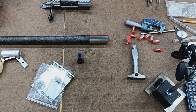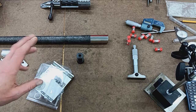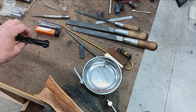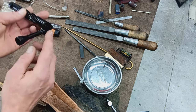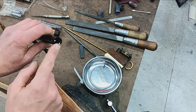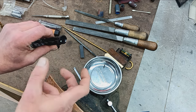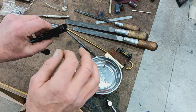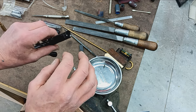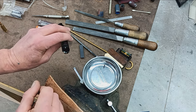We'll go over to the vise and take some measurements and record that data, get all our dimensions established for the barrel. Another thing to do before really anything else is preparing the bolt — we removed the firing pin assembly; we're also going to remove that spring-loaded ejector, which will interfere when we're headspacing. You don't want any pressure on the gauge during your final headspace check, because you want that bolt to have a tiny bit of resistance on the go gauge and then obviously a hard stop on a no-go gauge. We'll get that out to eliminate any false readings.